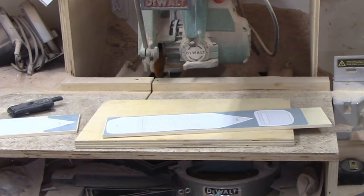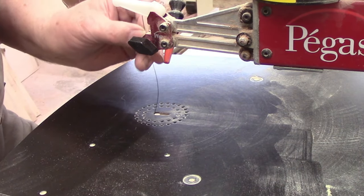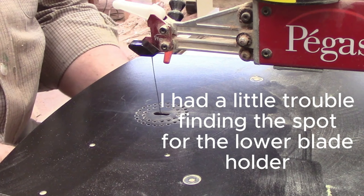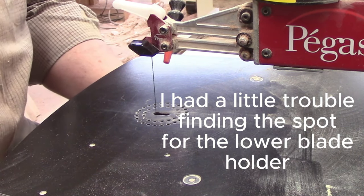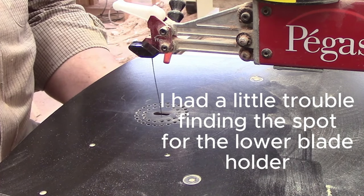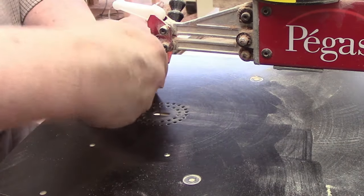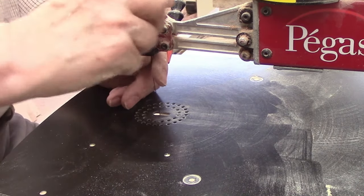Remember, the purpose of the tape is to keep the pattern from moving while you're cutting. For a quarter inch thick poplar, my choice of blade is a number three Pegas modified geometry blade. This is of course a Pegas scroll saw. I've had the saw about a year now and I absolutely love it. You change blades with an upper and lower blade holder tightened only with thumb screws — so much quicker and more convenient than saws that require tools for blade changes. If you're new to scroll sawing, you might want to watch my video on choosing the correct blade size — I'll leave a link on the screen and in the description.